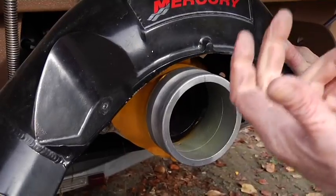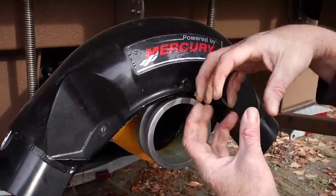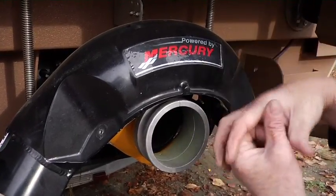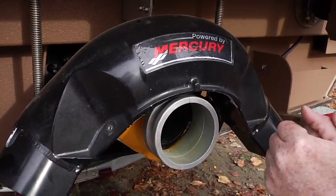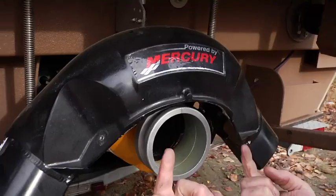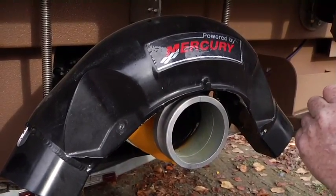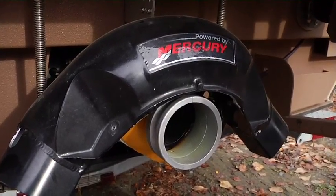And then on the bottom of the boat, there's two plugs for your gearbox, where the crankshaft turns 90 degrees to the drive shaft. There's a pinion gear, and there's about a 24-ounce oil cavity. Very simple. You get under the boat, you chase oil in one side till it runs out the other, and you do that once a year, and that's all there is to it. Very, very, very simple, low maintenance jet unit.